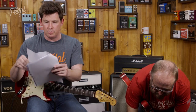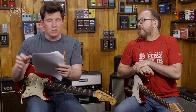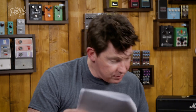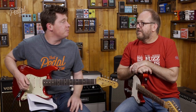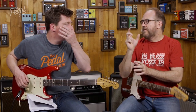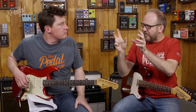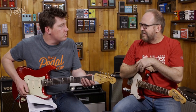We've done shows on tremolo before, and people go, why don't you ever talk about harmonic tremolo? Harmonic tremolo was a feature of certain Fender amps in the 50s. Maybe even in the 60s, I don't know, is the honest answer. And it has a particular phase, so have you found it? Do you know what harmonic tremolo is? It separated frequencies and it would do a top end and a lower end frequency and do a different modulation.